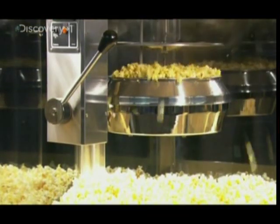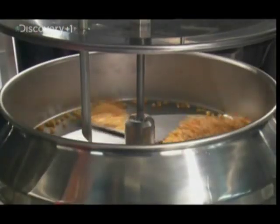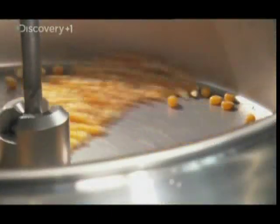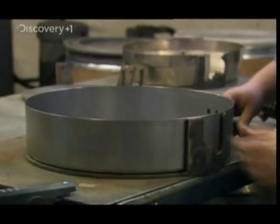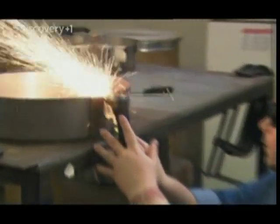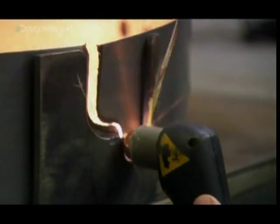The key is keeping the temperature high enough to pop the corn, but not so high that it burns — a smell most of us know all too well. The centre of the pot is where the heat is most concentrated, so four metal pieces called agitator legs rotate and push the kernels closer to the centre so each kernel cooks efficiently. The kettle's heating elements are covered by a retainer, with a notch sliced in the side so a rod or shaft can be inserted to later attach the kettles to the cabinet. A plasma cutter disintegrates the unwanted metal on the retainer — plasma is an ionised gas that melts the metal and blows it away in a shower of sparks.